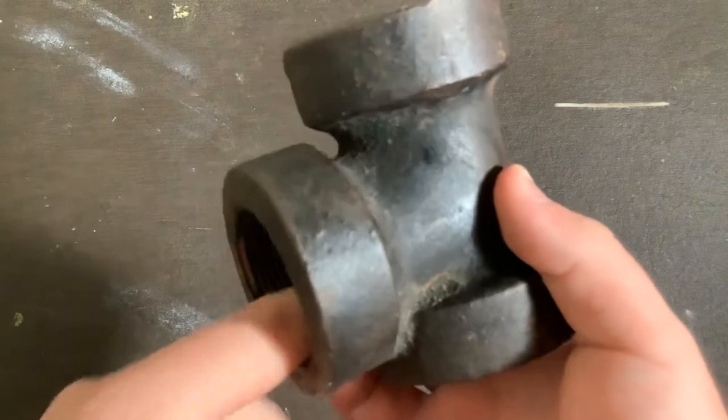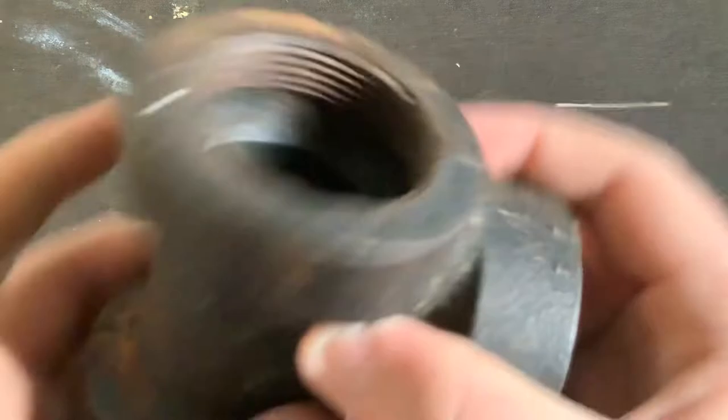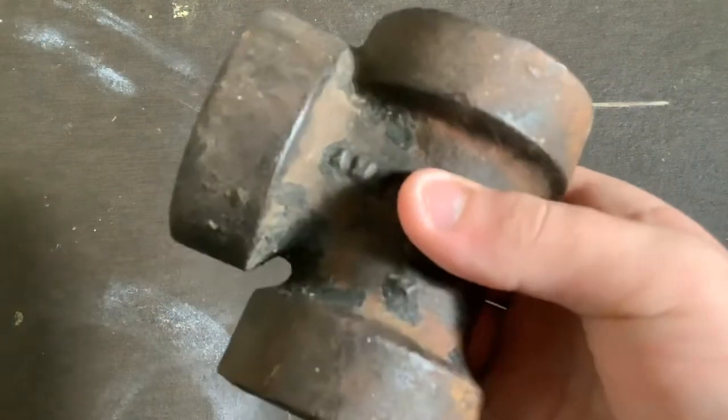If you put the fitting the wrong way there'd be a little water sitting in the bottom of the pipe. Inside it's a pretty typical old fitting — this is what a lot of people used back then. They had things like lead, but lead wasn't great because you had to solder it and bend it. Copper started to come out but wasn't that durable as a drain — not really a good drainage material. Galvanized was one of the best options available, and then plastic pipe came out in the 50s and 60s and replaced galvanized.